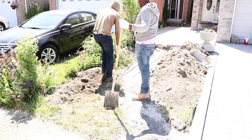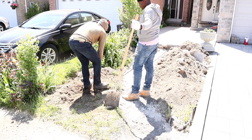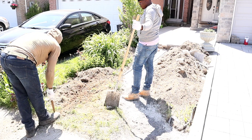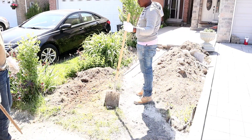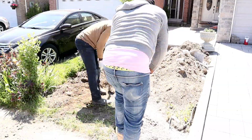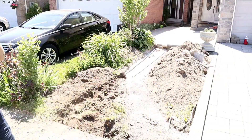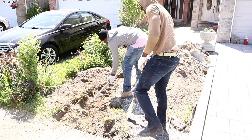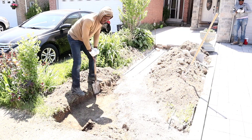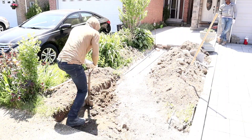Now Sanjay is removing the soil so I can mark out the new layout. It's gonna run straight for the L to the house, come all the way out to the road, and then make an L shape right there — so it's gonna be square right there. You want to dig out at least nine inches deep and compact the dirt itself before you put your sub base. It's always important to have a stable base.